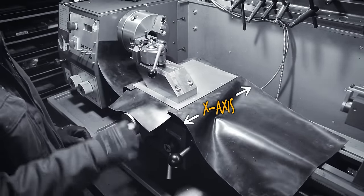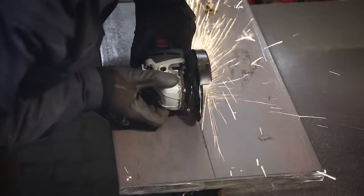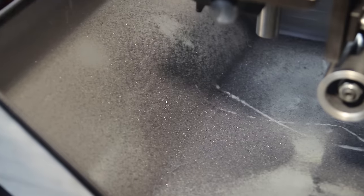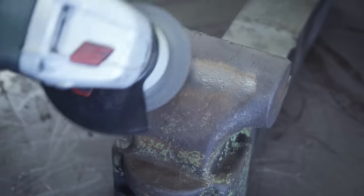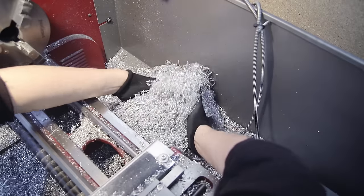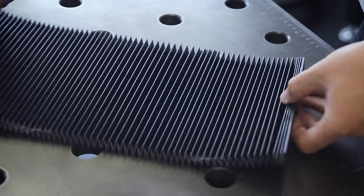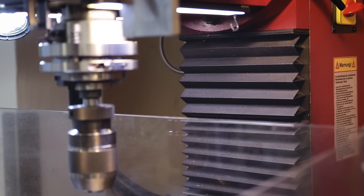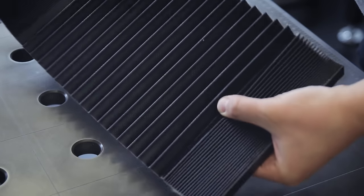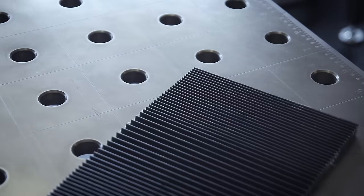The reason why I'm adding the covers at all is not so much to protect the lathe from its own chips, which it's designed to deal with. The main reason is that my whole shop is in a single room, and that means whenever I have to do stuff like grinding and sanding, the grinding dust that flies around the room can also settle on the lathe bed. Those abrasive particles are really bad for anything that has precision ground surfaces like a lathe or mill, because they increase the wear on the ways to a huge degree unless you constantly clean the machine. So the way covers should protect against that somewhat, and in addition the covers also make cleaning up the normal chips a lot more convenient. For the new version I want to use this accordion style material, which is one of the standard solutions to protect moving parts on machine tools. I bought this material on AliExpress and I'll put a link in the description, but I think they also sell something like this at McMaster-Carr and some similar places.